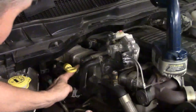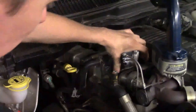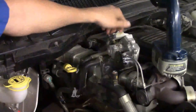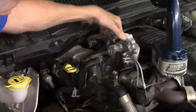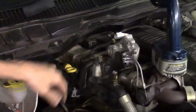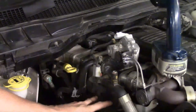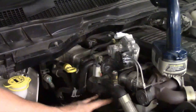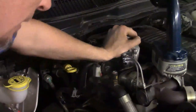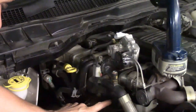Keep in mind there are a few things mounted to the outside of the cooler — coolant hoses at the rear and the front, and the EGR control valve assembly that needs to come loose. That valve has a two-stage lock like the air inlet: lift up on the primary lock, squeeze the secondary, and move it to the side. Don't take the cables loose, leave those there. There are two 10-millimeter bolts on the side and two on the back between the valve cover to get this assembly off. There's also a coolant pipe with a bolt nearby that will need to come off.